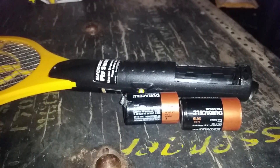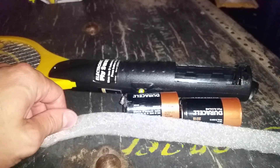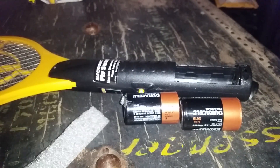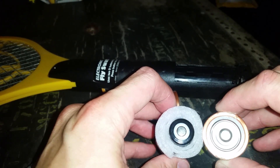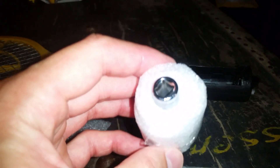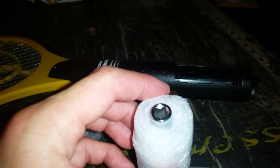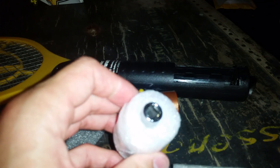Here's what I did. I wrapped the 18650 in this foam packing material and taped it up, so it's about the same diameter as a D-cell, a little bit bigger. The other thing I did was take a socket — I'm not sure what size, but it's a quarter-inch long socket. Basically, this end just needs to make contact with the spring inside.